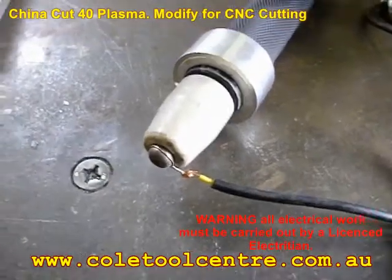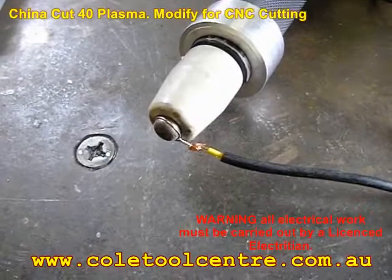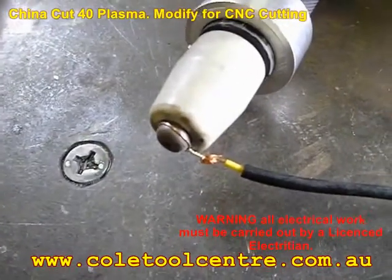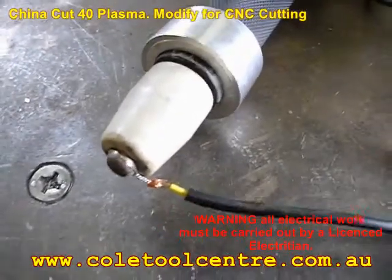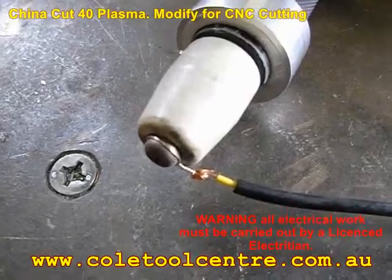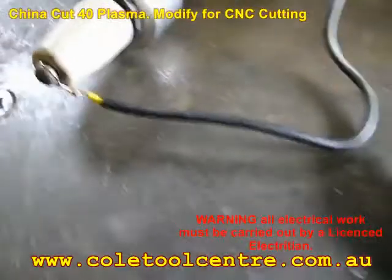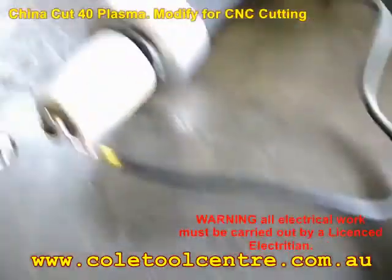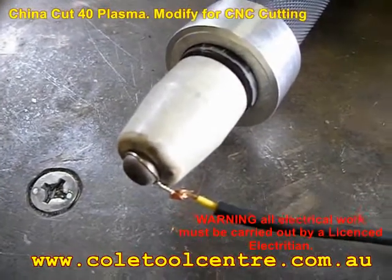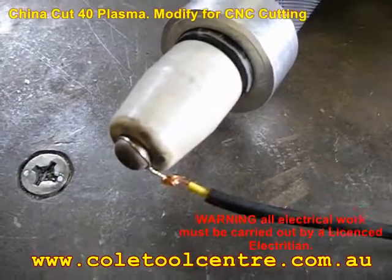We have to consider that this is a consumable with a wire here, because it gets quite hot and it will break away quite easily. I'm basically just using the stainless steel wire to get it onto the end. I've actually ordered some longer nose pieces, which will give a bit more clearance and get some of the heat away from the wire. The other end of the wire just has a clip which goes onto the earth clamp on the job.